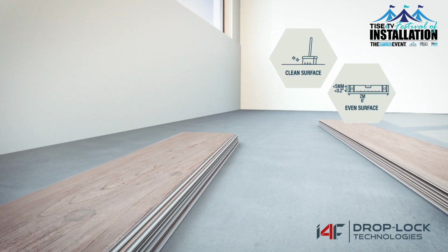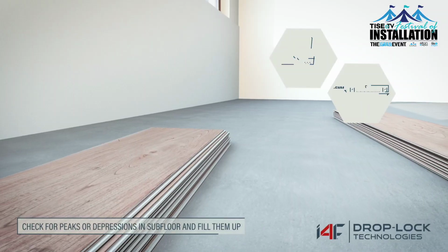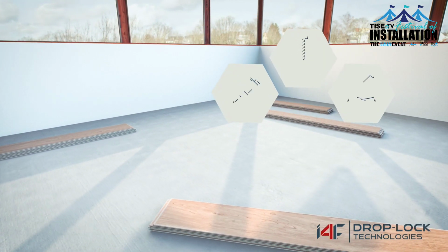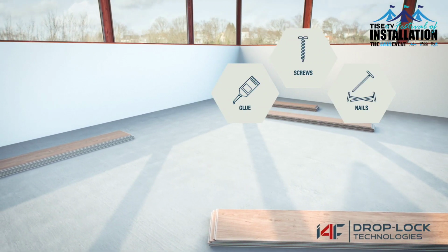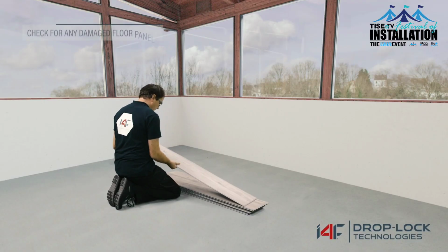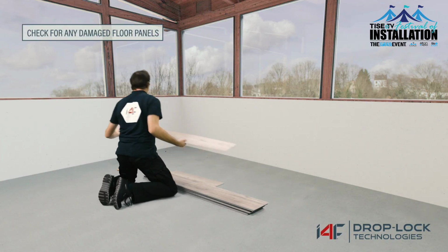Subfloor. Make sure your floor surface is clean and even. Check for any peaks or depressions in your subfloor, and if they exist, fill them up with cement paste. Remove any last obstructions such as glue, nails, or screws, etc. And before starting, check the flooring panels for any damages. Now you are ready to begin installing.